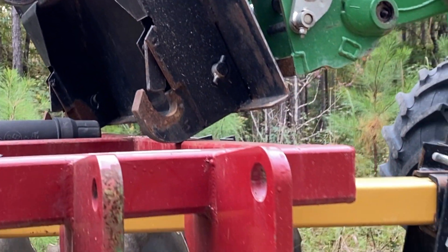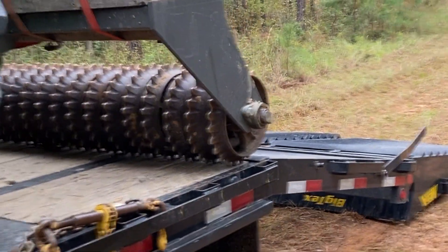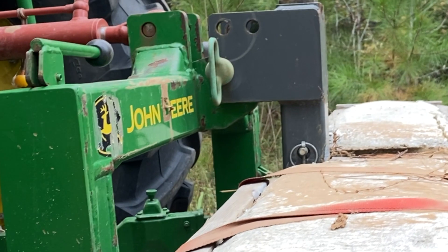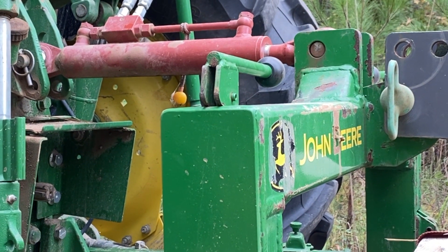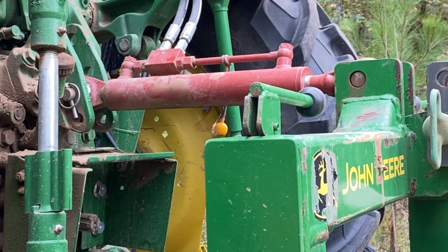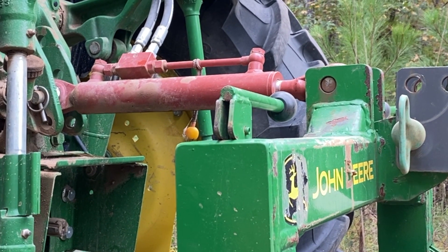To give you an idea of what we got: if you look at the tractor here, I run everything on a quick hitch. That's your three-point hitch, but instead of having to get off and pin your implement on, you just more or less back up underneath it and pick it up. I run a hydraulic top link, and that lets me control the angle of the implements on there, which is real handy running that disc because I can get it level without having to get off and screw or unscrew a regular style top link.